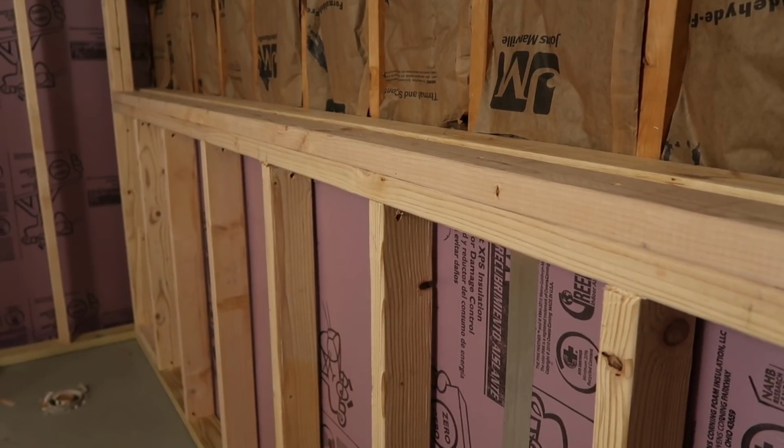And so that's why I decided to just go ahead and build the stud wall, for a few additional reasons too. One, it makes doing electrical easier. You can just put the receptacles on there and run the wires either behind it or through it. It keeps that really simple and consistent. And it's a little bit of additional soundproofing, because technically these walls are not attached to the exterior walls. They're attached to the floor and to the ceiling.